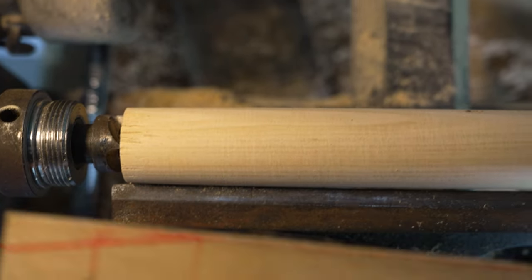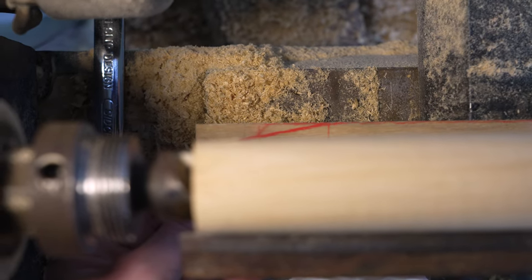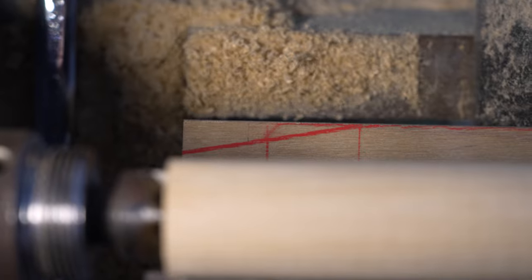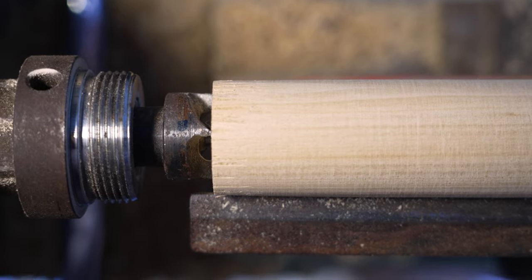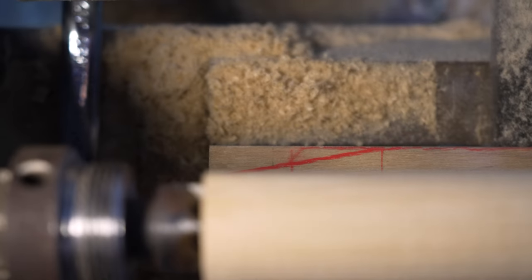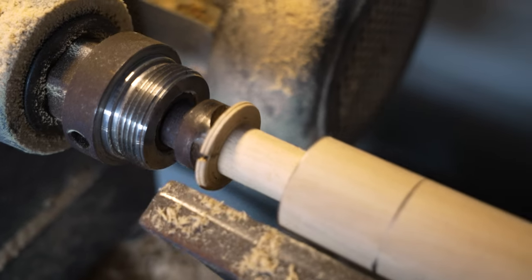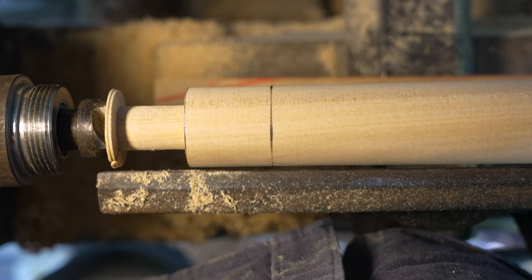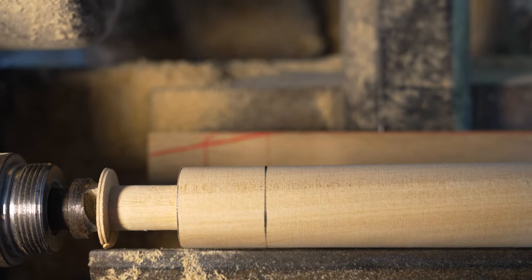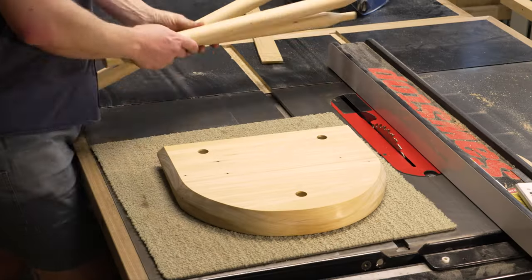I don't know if this technique is commonly used or incredibly frowned upon. I can see where you might think it's a bit inaccurate, but standing over the piece, you can line that scrap piece up and, as you lean over, get the red line lining up with the rest of the leg and just copy that line to get a matching profile. I've got the diameter set at 19mm, so that'll be a nice snug fit in the seat base. Then I just hatch that angle and create that taper. This was hard to explain and hard to film, so I hope that makes sense.